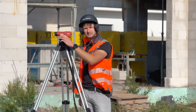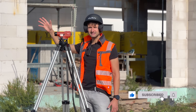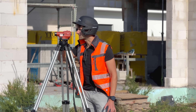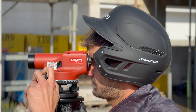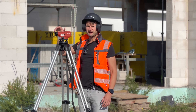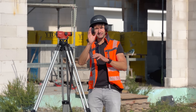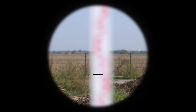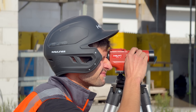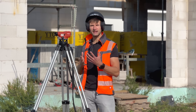With this small side wheel you can slowly turn the device. So if you have the leveling rod at a great distance, far away, you are not able to turn the telescope gently by hand to catch it. That's why you turn these small wheels to slowly get to the center of the rod. And finally, this bigger side screw sharpens what you see through the telescope. Look at the leveling rod — at first you see it completely out of focus, but by turning this screw you sharpen the image and see clearly both the rod and the crosshairs, and you can read the value.